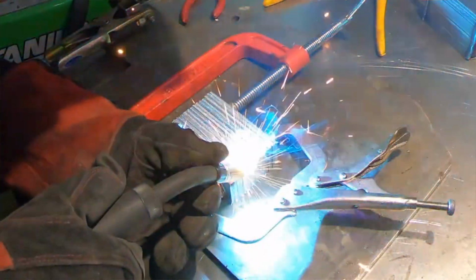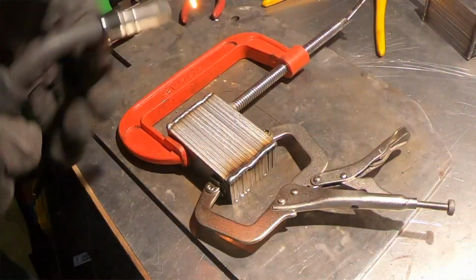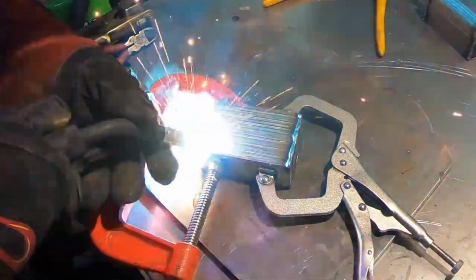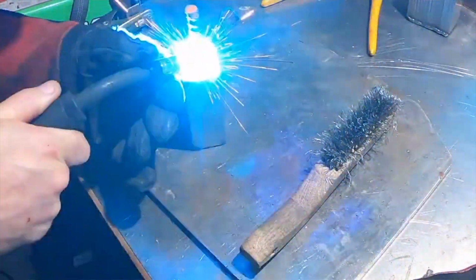The next is keeping those together while you're forging, which involves some tack welds. So whether you're using a stick welder or a MIG welder, tack those together. When I do a billet, I try not to weld down the sides of a billet. I usually only do the corners because I don't want any of that mild steel weld in my billet. And I know if I put it on the corners of the billet, those are going to end up getting cut off anyway. So be careful and think about where you're going to put your weld.